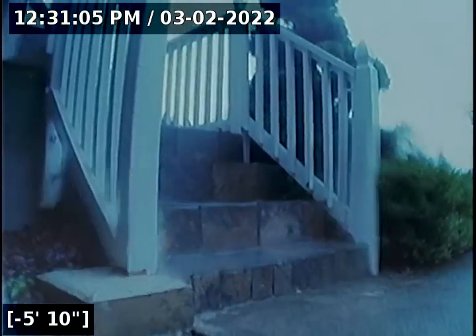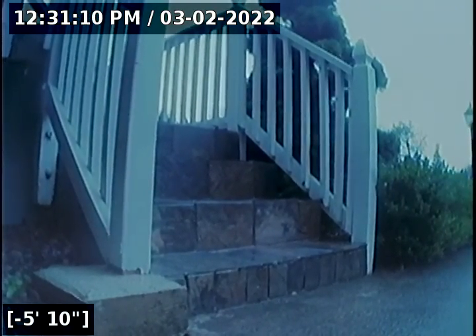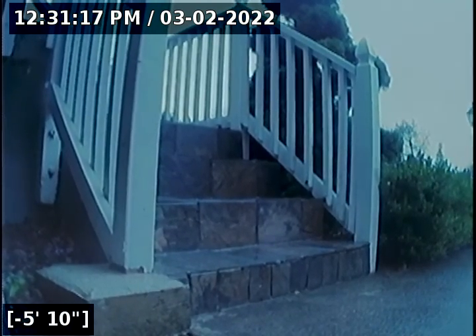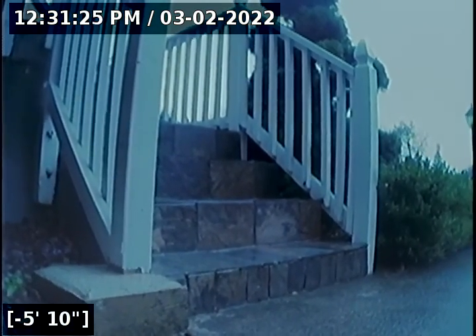As you saw going to and from the city main, there are no issues of concern at this time. Seeing corrosion is pretty common in old cast iron, but I didn't see any cracks, holes, root intrusions, or offset joints — no bellies in the line retaining water. This is a passing sewer line camera inspection for this property. You will have to monitor the cast iron as it does have a life to it, but at this point it's serviceable and passes. I will have a written report with this video upload for you. Thank you for choosing Lantern Inspections.